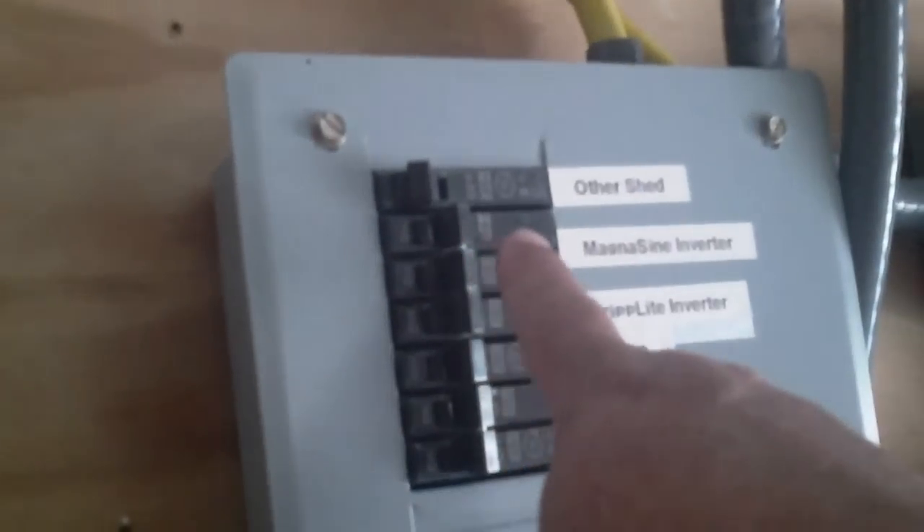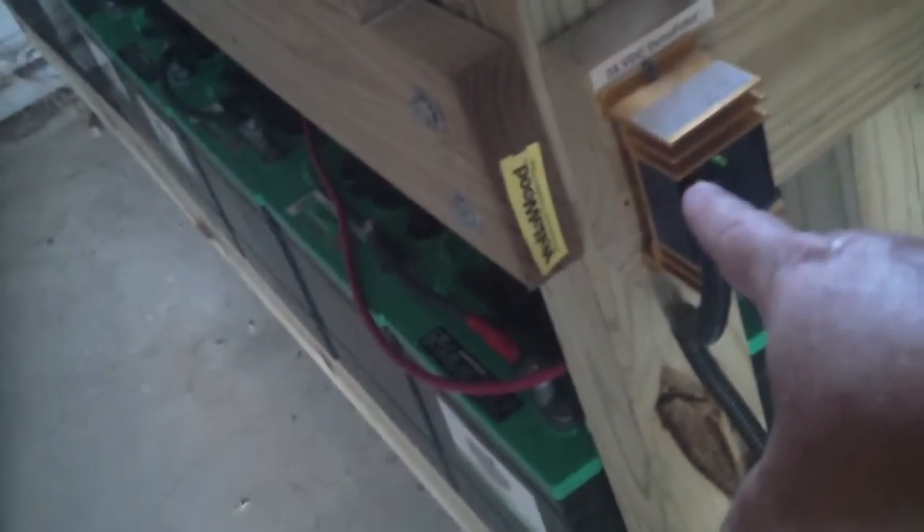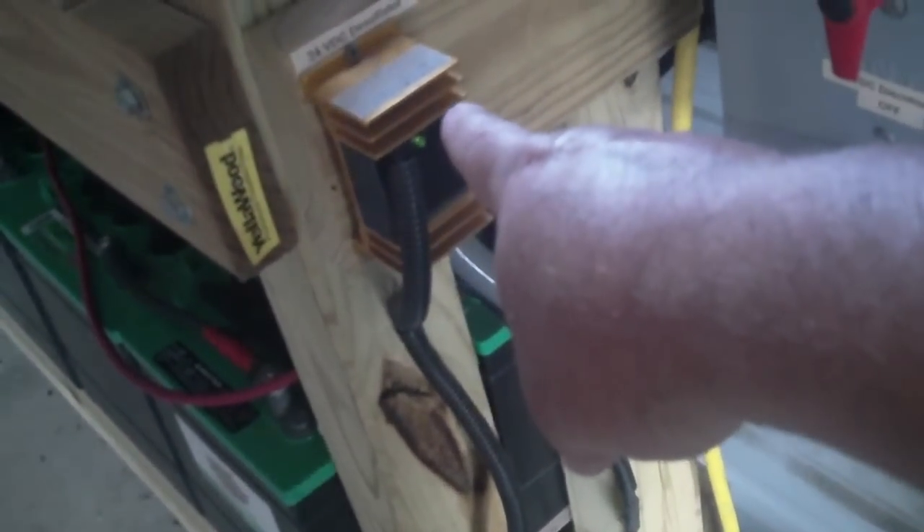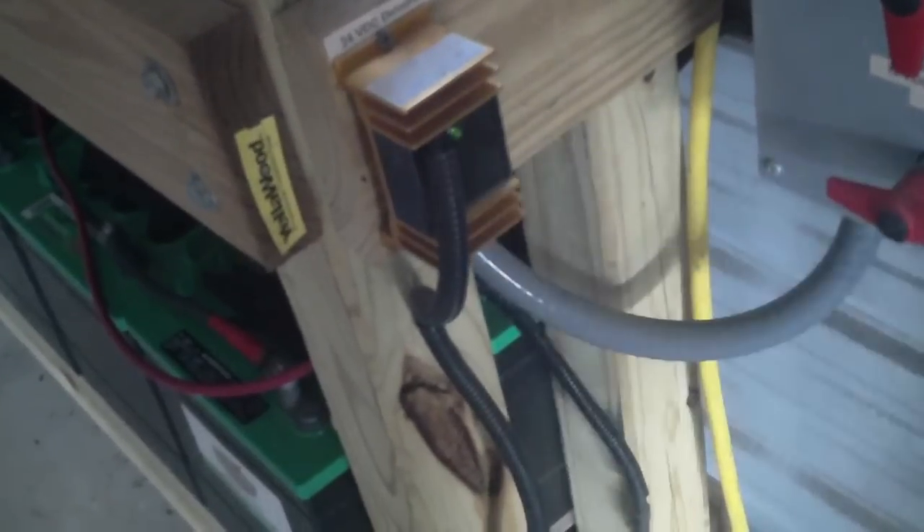It's climbed up to 18 amps. I'll do that until I get up tomorrow morning — when I get up, I'll turn that breaker on again, which will force this to go into an equalized charge. That will force any sulfation on the plates to go away, until I get my new forklift-size battery desulfator put in place. Then I'll keep the smaller one in reserve for my regular vehicle batteries.